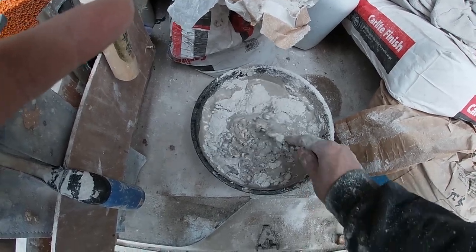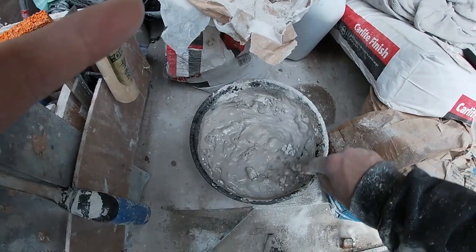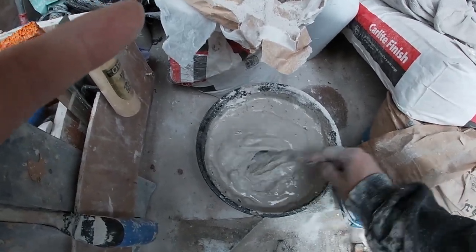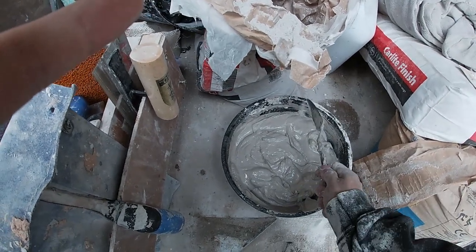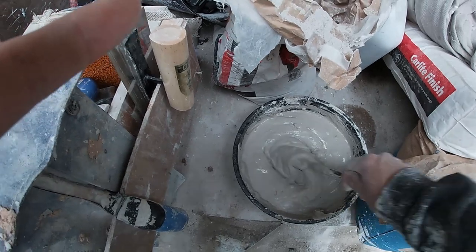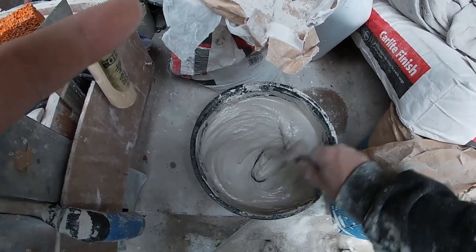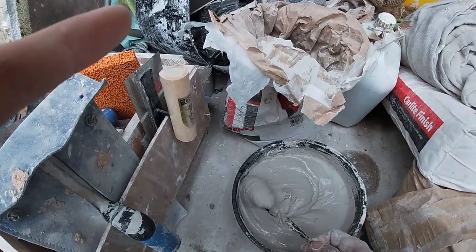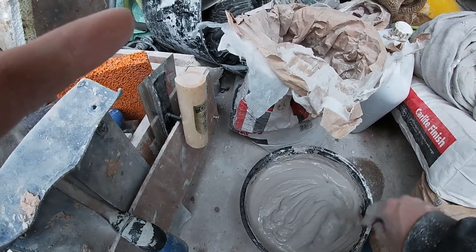You can see me just using a small tool and a bowl for this next job — really just snagging around sockets and a couple of small cracks around spotlights. It's handy because I'm not waiting for the sand cement to pick up; I can go ahead and do something else while it's setting off. If you put sand cement on too heavy it won't go — even in a four-inch by four-inch hole it could fishmouth at the top and drop out, putting you back to square one. Use your time wisely: maybe go and look at another job while you're waiting.